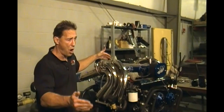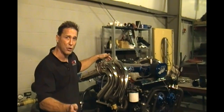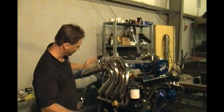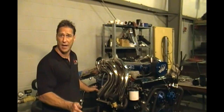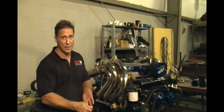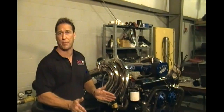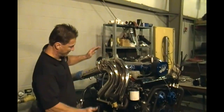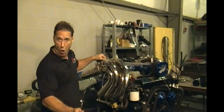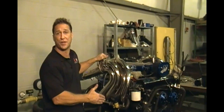People say, 'I've got plenty of water — my water pressure is actually higher.' But you're going to get a higher water pressure reading on your dash because you've got blockage. It could be seaweed, sand, parts of an impeller, or corrosion. People think they have plenty of water, but they don't. It's the amount of water flow in gallons per minute that it takes to cool these headers.